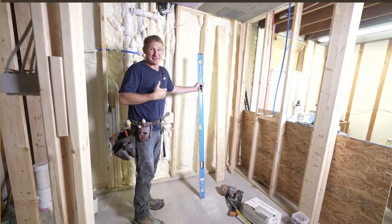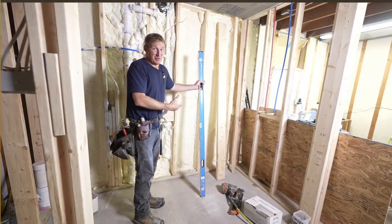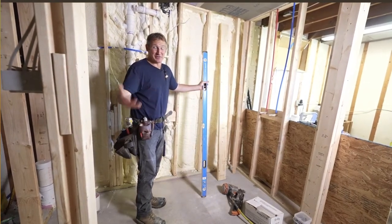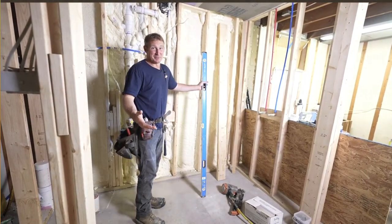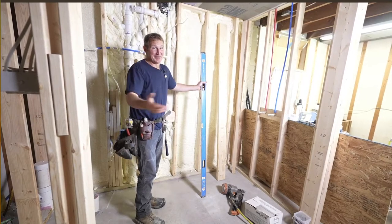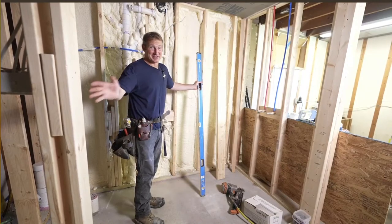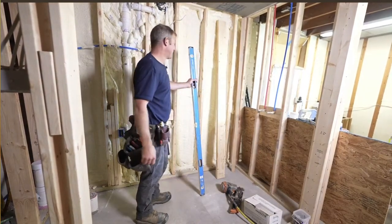There's nothing worse to me than having plug anchors in drywall. I mean, there are some good ones out there, but most of the time they don't last over time, and that's always the troublesome part. So if you're a contractor, definitely put blocking. It's going to make everything last a lot longer. You won't get any callbacks about any of your accessories falling out of the wall.